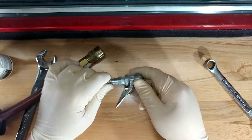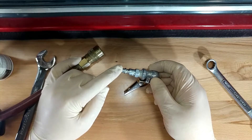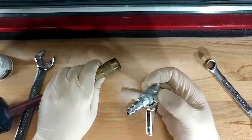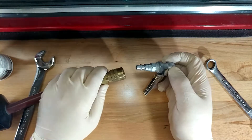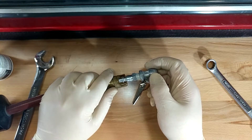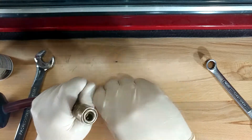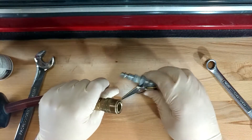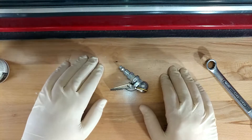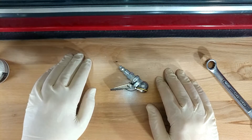It is my opinion that if you have a whole bunch of tools you're doing — recently I went through and replaced all the fittings on my air tools with Milton fittings because I got tired of all the junk ones leaking. All of these are now Milton made in USA, and I've been happy with them so far. If you're doing a whole boatload of fittings, the joint compound is much, much faster — you can just put ten fittings out, grease them all up, slap them together, and off you go. However, one of the last ones I did in Teflon tape has always been a leaker, so let's get that fixed.